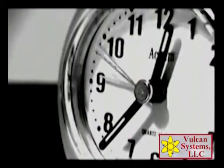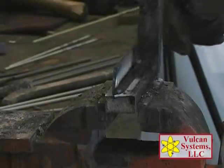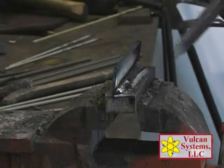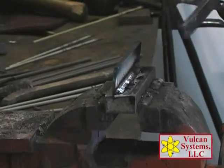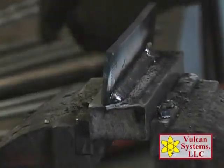We'll just let that cool down for a few minutes. The slag will release at a certain temperature, which protects the weld from the atmosphere. After allowing it to cool for a couple of minutes, we're going to remove the slag. We'll give it a brush.